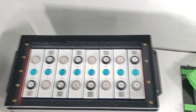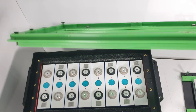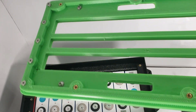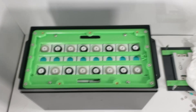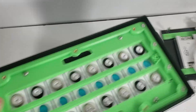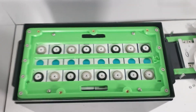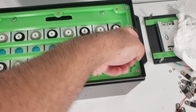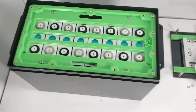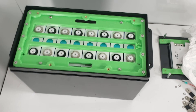The next thing we're going to do is put this plate on. This is a double-decker plate, super strong, and as you can see it's got two separate layers that have been sandwiched together — extremely rigid. We're going to go ahead and install this and secure this, and once that's done we'll begin installing the bus bars and BMS balancing wires. With our top plate installed, these cells are not moving or budging at all. The compression of the plate will actually compress the foam further, so now you have it fully enclosed. One of the cool things about the 8S version is you have insulation on all sides — this will be super insulated, which may be a good effect depending on your temperature environment. Full perimeter-based insulation.